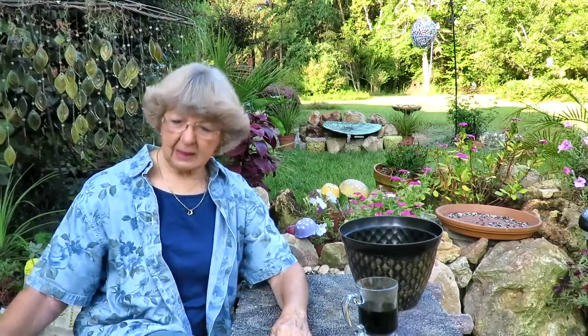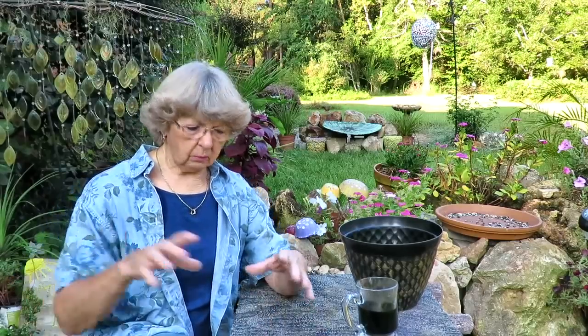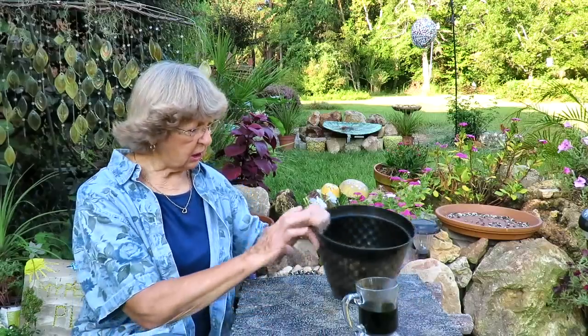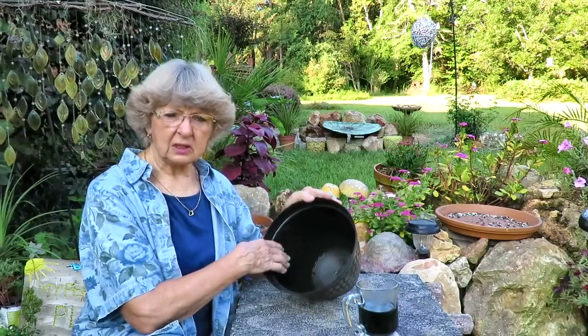It'll be fun. Anyway, I make my Portland cement with one part Portland cement, two parts sand. And that is, if you put 1 cup of cement, then you put 2 cups of sand. If you put 6 cups of cement, you put 12 cups of sand. And you mix it with water, you stir it up, whatever consistency that you like. Most of the time, I like a firmer mixture, like it'll stick. You know, if you stick it in here, it'll stay, like, on the sides. Well, that's what I usually use, but sometimes it will get a little thin if you don't watch it.